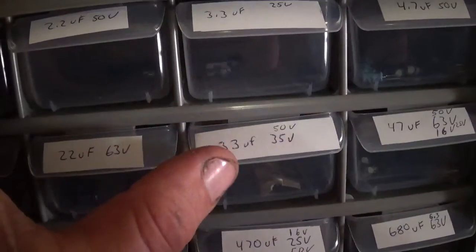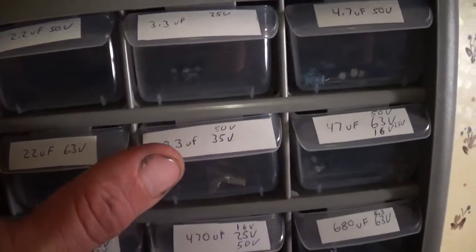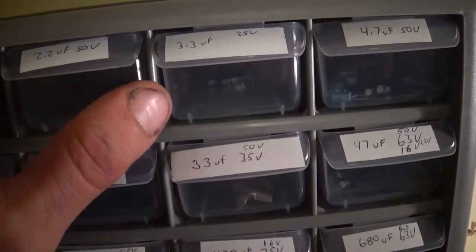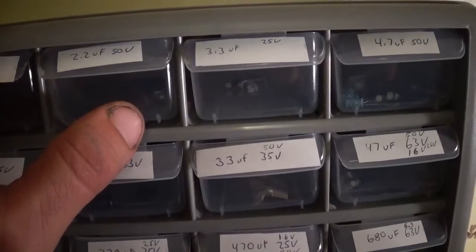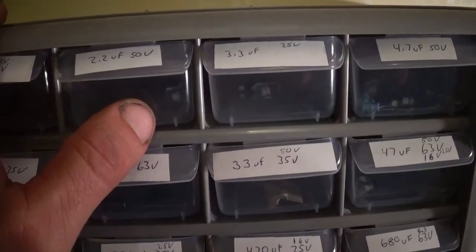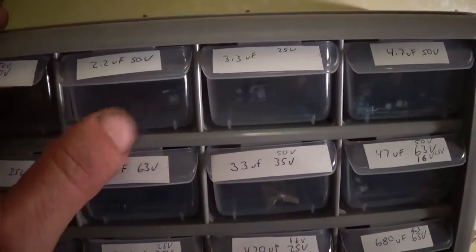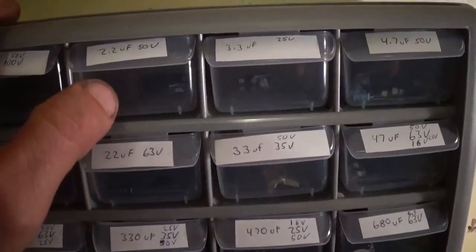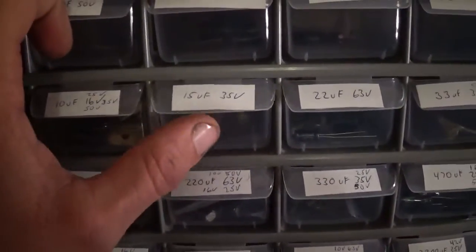The more capacitance the capacitor has, the more mid-range and bass you'll get coming through that full-range speaker. And the lower the capacitance, the more tweeter-like it'll be. For a mid-range speaker, it really doesn't do bass very well, and it doesn't do tweeter very well, really sharp highs. So trying to use it as a tweeter really doesn't work very well. But yeah, I just thought I'd show a little bit more on that.